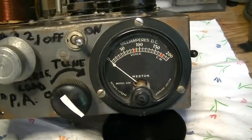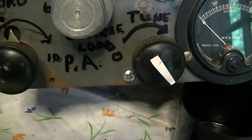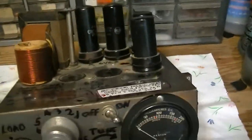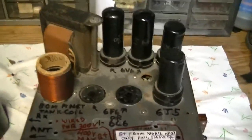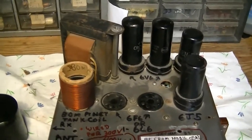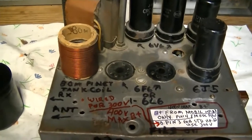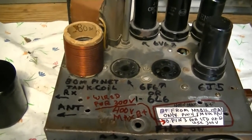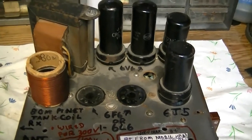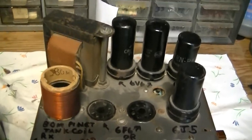The meter's classic World War II surplus. These knobs are Bakelite knobs from the 30s — that happens to be a Moro knob. The tubes are all tubes that could be salvaged from home broadcast sets. 6V6s and 6F6s are typical audio output tubes in a table radio. A 6J5 and 6SC7 you can also find in a 5 or 6 tube AM radio.